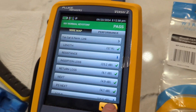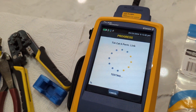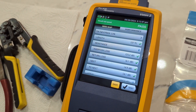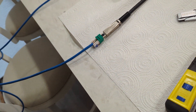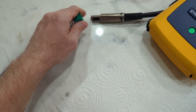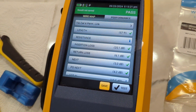Let's hit test again and see what happens — I'm just curious how consistent it is. If we keep running the same test and getting different results, how I change my terminations might adjust things. We're holding at 6.1 decibel loss here.